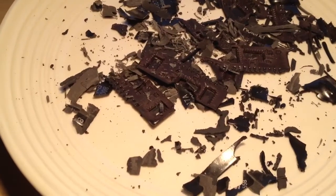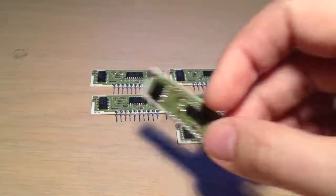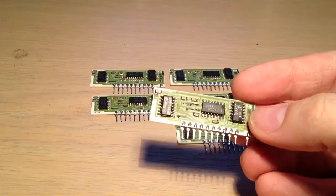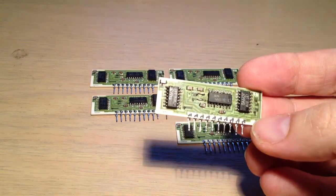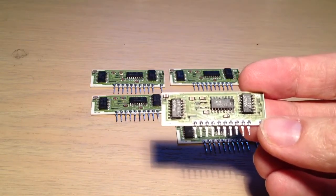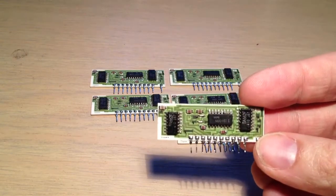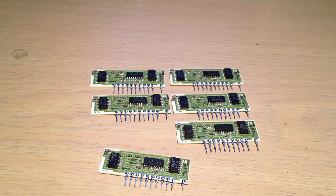for just 6 chips. But the only one I'm slightly worried about is this one, which seems to be the worst made of them all. The solder's very blotchy, and this is the chip where the pins lifted when I took the coating off. So I want to put that in the board on the very end of the line, just so I know where it is, basically. I'm not sure if that's voice module 1 or voice module 6. I'll have to look at some of the other doco online where someone's worked that out.